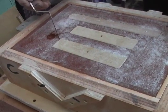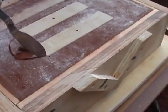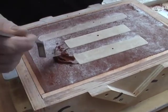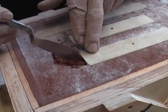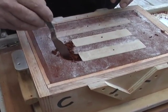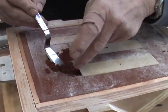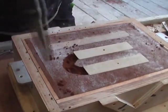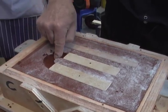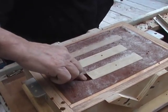We could almost join the two together. When the aluminium hits the sand, it keeps it in place. Obviously the mould could collapse, but there is an eventuality where the thing you thought wouldn't happen does happen, and so the casting is not as good as what you wanted. If the process we carried out has been done well enough, the sand will stay in place. There are times when things go wrong and you just have to accept it and try to avoid it the next time.